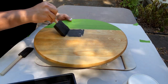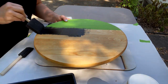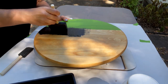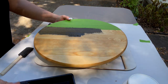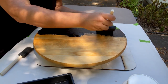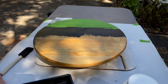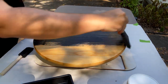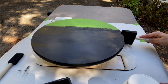We go ahead and distribute the chalk paint into a small painter's tray. With the same rule set, we distribute it side to side and from the frog tape down onto the now-being-painted wood, but never up. You don't want to push anything into or underneath that tape, so just make sure you're being gentle. We're not going to let this paint dry and then do a second coat, so we're getting as much paint down as we can to ensure it has the level of opaqueness we're looking for — all in one coat — including the edges.